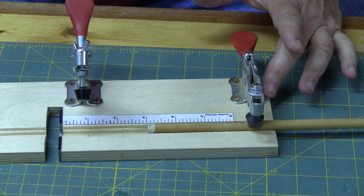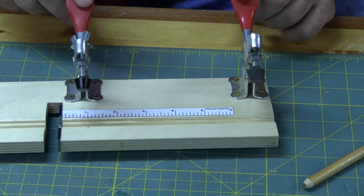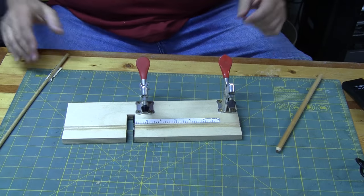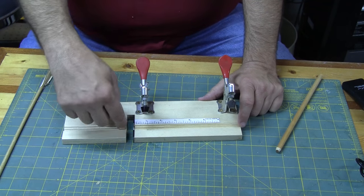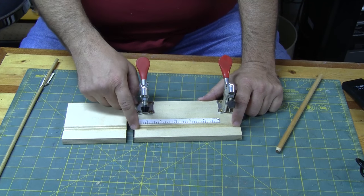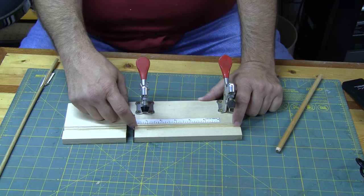The jig is 12 inches long and about 4 inches deep. These hold-down clamps you can get at Woodcraft. Neither clamp is absolutely necessary — I added them because I was playing around in the shop. The two things you really need are a router with a v-groove bit to cut the groove, and the piece of steel, which I think is actually pretty important. I used a Dremel tool to cut it to length and mostly a grinder to put the v-notch in.